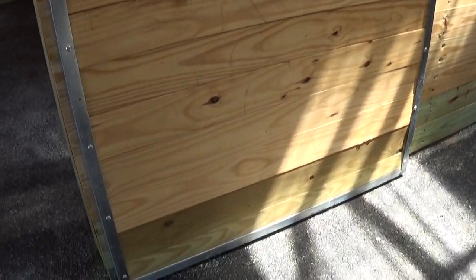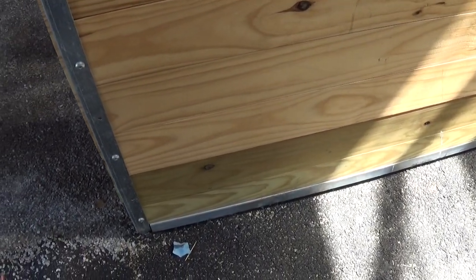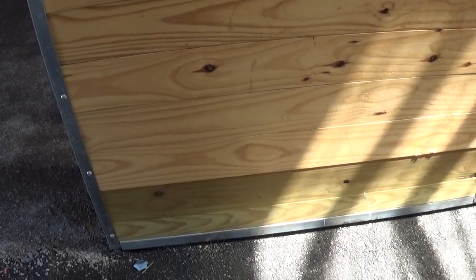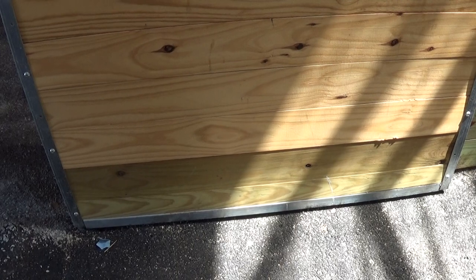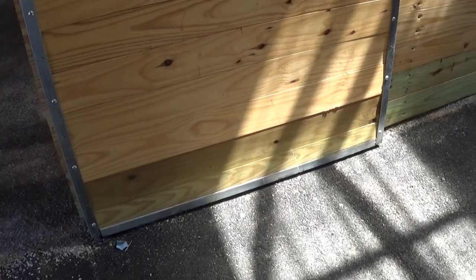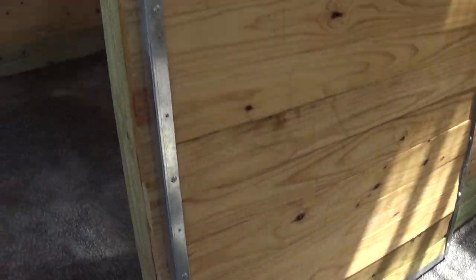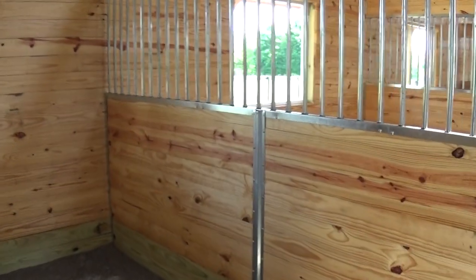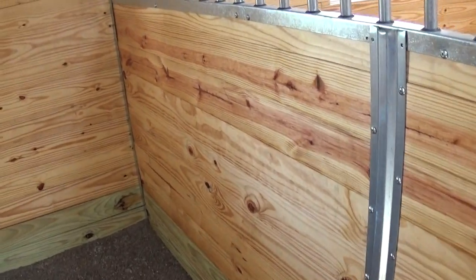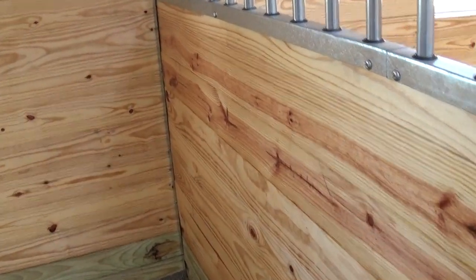In this barn, there are all kinds of places. Down here at the bottom, this track on the door could hold some water. The sun will pull that water out, and if we have polyurethane on the bottom of this stall door, I guarantee you'll see peeling within several years, maybe three or four. Polyurethane never works. Marine spar varnish never works in a horse barn because it's a film-forming hard shell finish.